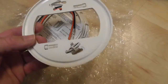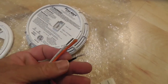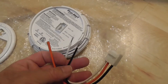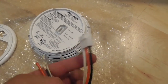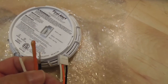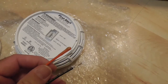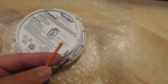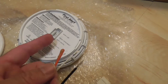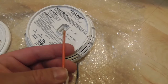There's a power connector with a standard black wire to black, white to white. There's also a red wire — if you have multiple smoke detectors in the house interconnected with this red wire, then if one detector triggers, all the alarms go off simultaneously. Most homes don't have that setup, but that's what the red wire is for.